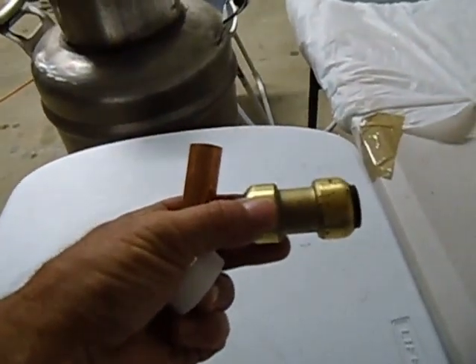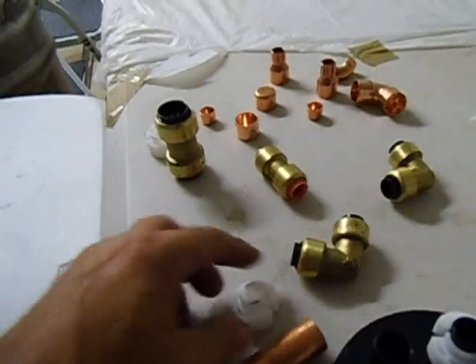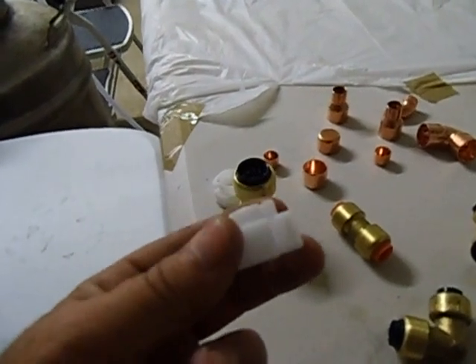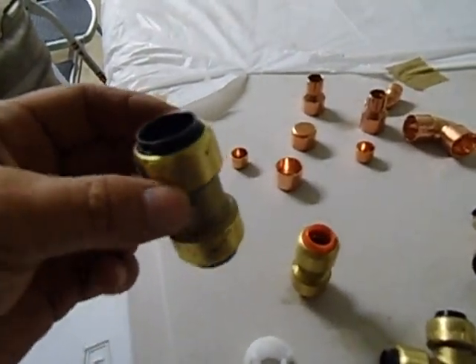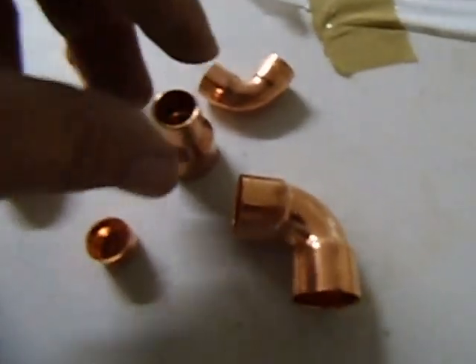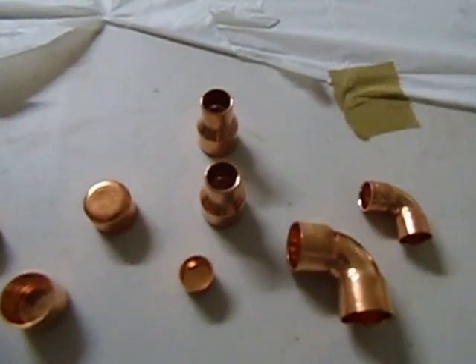These fittings are expensive — they've got $10 each, but you get them in different sizes. You can also get the releasing tools from some plumbers or maybe some auto shops. You get half inch straight, that's a half inch straight; that's a 20mm; that's a half inch elbow; and just a couple of other elbows and reducers, and a half inch 90-degree bend that I'm going to use to make other things up later on. It's easier to connect and disconnect.